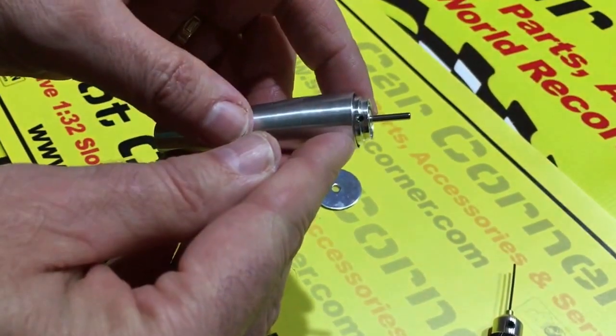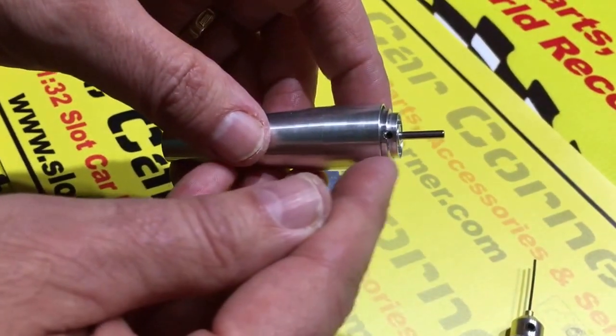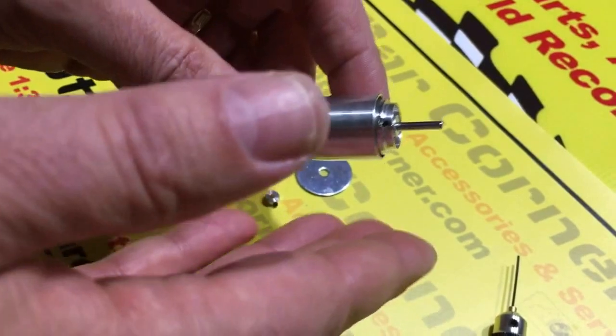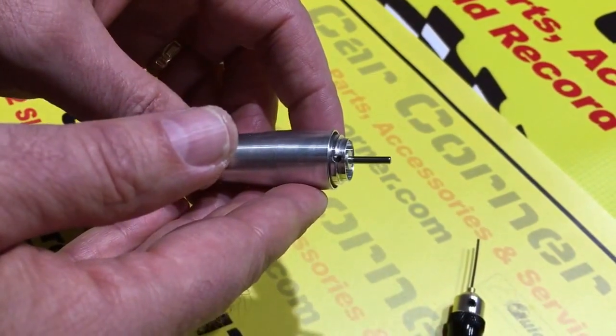This is a rib wheel with a center rib, so we want the entire shoulder on the backside of the wheel to be showing and just a little bit of that center rib — roughly one-third of the entire width of the wheel. If you're using a wheel that doesn't have a center rib, that's fine — just roughly one-third of the wheel should be exposed from the tool.